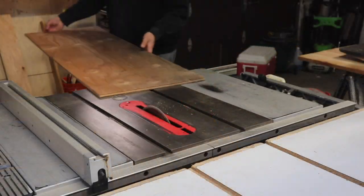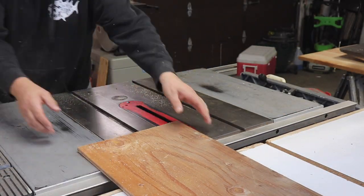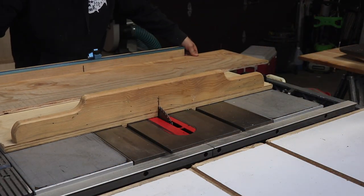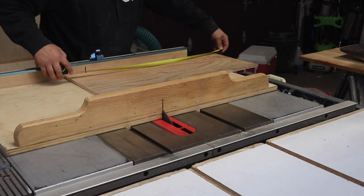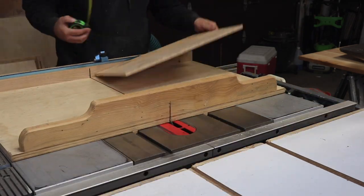Now I'll be cutting the drawer dividers and the bottom boards to finish dimensions. I'll use a dado to secure the drawer dividers and pocket screws for the bottom panel so I can move it if need be. I'll also be edging these boards with a piece of mahogany to make them look pretty. I don't want to look at ugly old plywood on the finished piece.